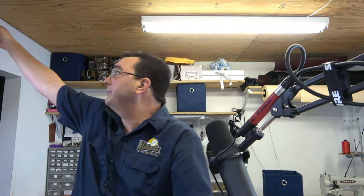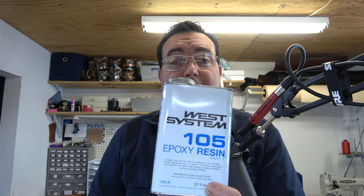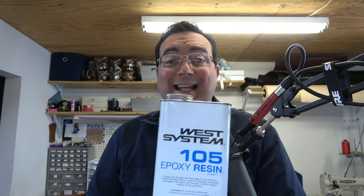So anyway, we finally got something that is close enough, and I've got it working. Well, we went out to the customer's house day before yesterday, and we were gonna go ahead and start assembling the table, when, come to find out, the epoxy, which is the West Systems Marine Epoxy, and believe it or not, this stuff really is good. It is fantastic stuff. However, maybe it had something to do with the expansion and contraction of the wood and lack thereof of the slate, but the slate liners have popped off.